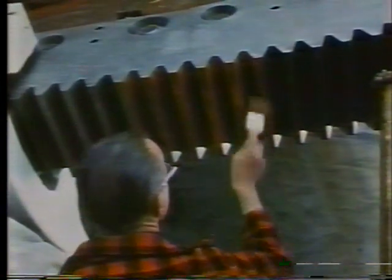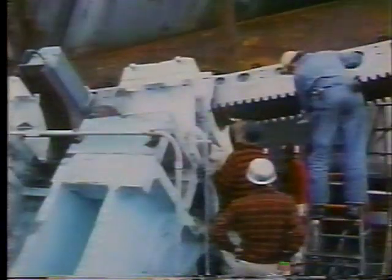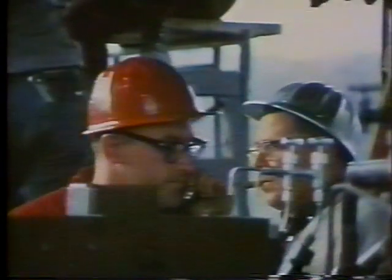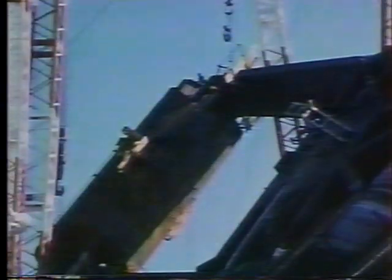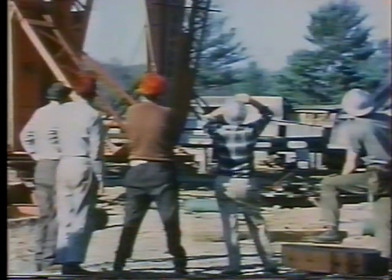The polar gear is red-leaded to show tooth contact. The brakes are released with observatory operators at the power package on the main deck, at brake stations 1 floor below, in the pump room on the 2nd floor, and at the main console down on the ground floor. Communication is established and the first test of the structure in rotation under its power begins, and is successful. The bouncing has gone. The mechanism will be stable.